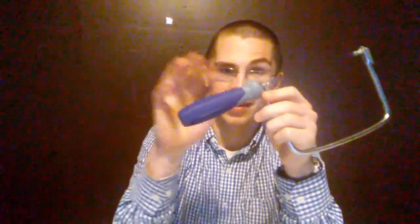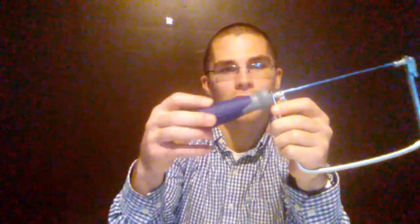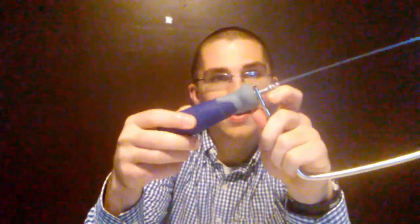Now that you know how to rotate the blade, let's get into how you remove and replace it. The first thing is to realize that there is a bolt and we can untwist the handle — the blade is currently only held by tension. By rotating it counter-clockwise, we are able to lower the tension on the blade. You can see the tab getting closer to the end of the frame as the blade loses tension. There's going to be a point where the handle starts to get loose, and that's when you can take out the blade — just simply pull it out.